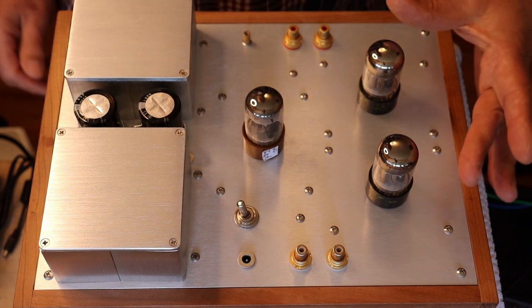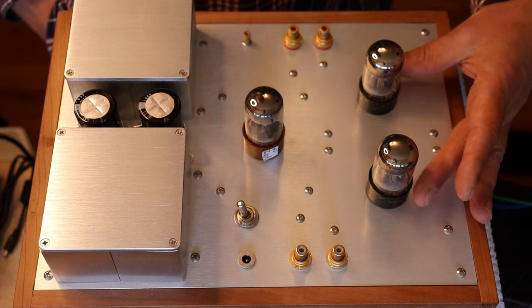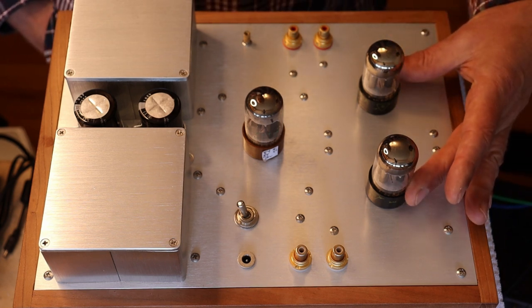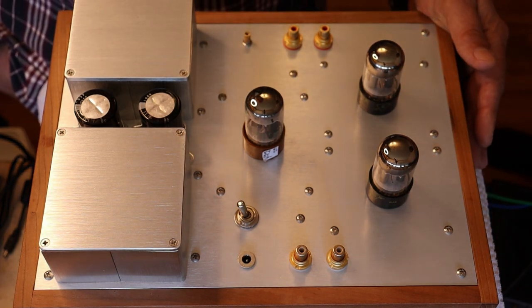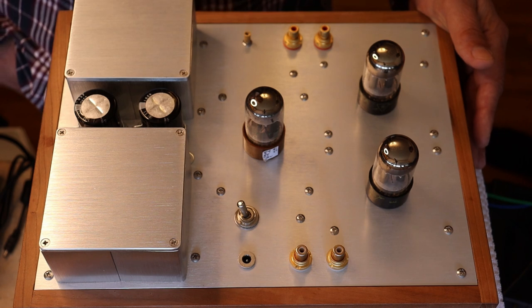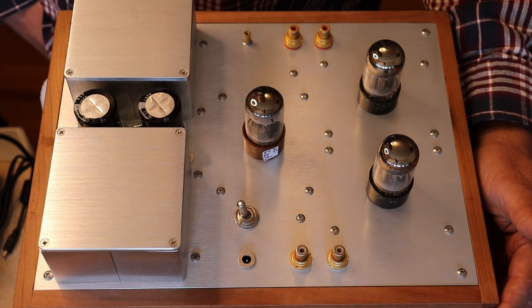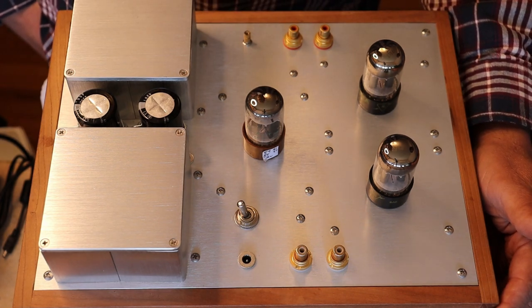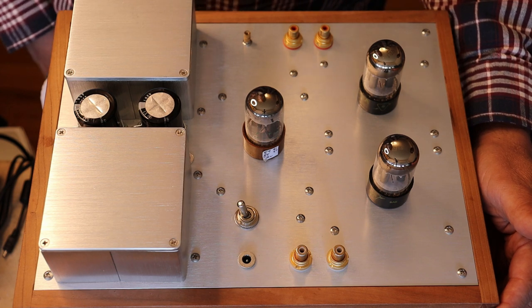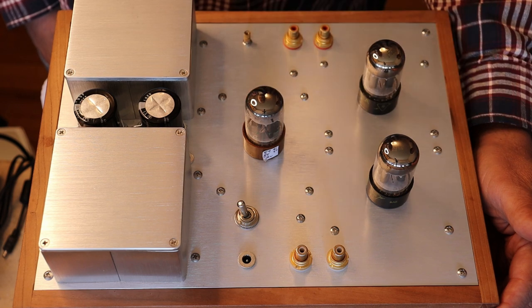And it's based on the voltage gain tubes. Right now we've got the 12SL7s in, but it's going to play everything like the 6SL7, just with a simple swap of the heater voltage, just like with the Universal. Also the loctal equivalents, like the 7F7 and the 14F7. And there's more tubes too, aren't there? Well, we've got something a little bit different here in the cathode follower stage, and that is a 12SN7.